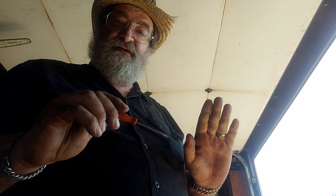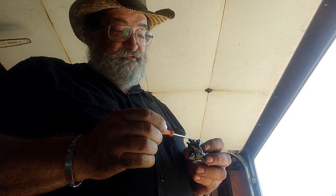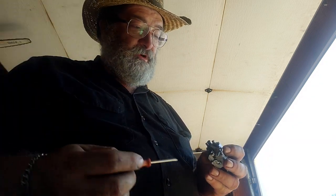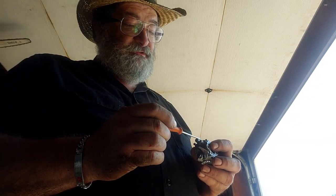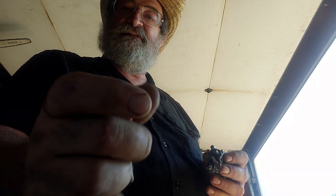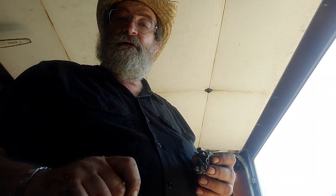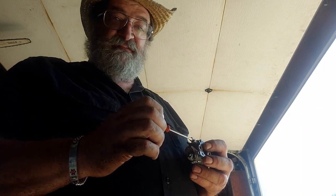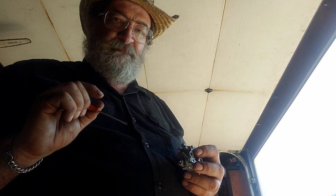When you've found the sweet spot on the high side, you're done. What I always do, just to make sure, is once I have that sweet spot I'll turn down the idle to where the chain's not moving, and then just barely touch the low side just a little bit to see if I can get that sweet spot honed in even more perfectly.